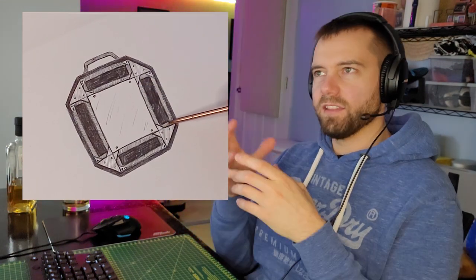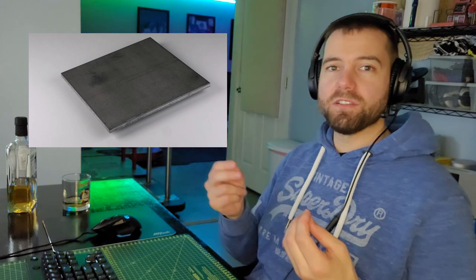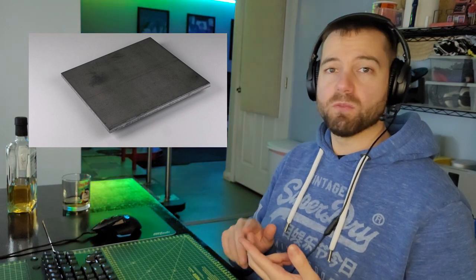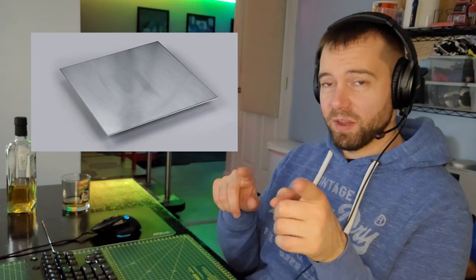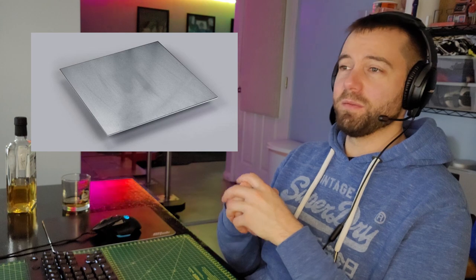One of the reasons I wanted to make this video is I wanted to introduce my project, but I also wanted some help from you guys. The first question is: what should I make the base out of? My first inclination was plate steel — that's what I did on my custom pad and it worked very well. Steel is strong, relatively flat, and not too expensive. The best thing is you can drill a hole right through it and tap it, so anywhere you need a bolt you just drill and tap a threaded hole. But I Googled some weight calculators and it would be really, really heavy — so steel isn't going to work out. Then I looked at aluminum — a thick slab of aluminum would do it, but aluminum is crazy expensive in that form factor, so I don't think I'm going to do that.